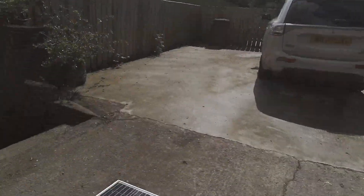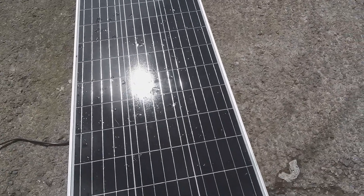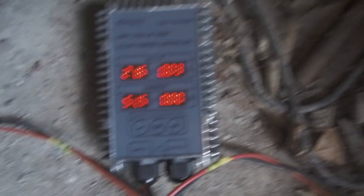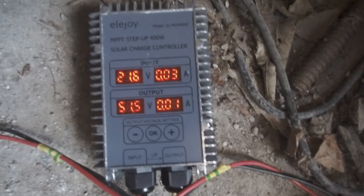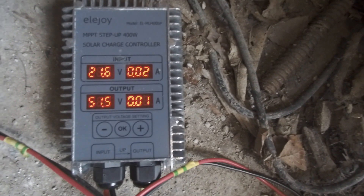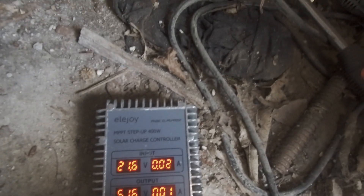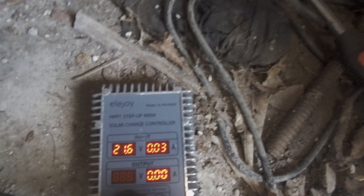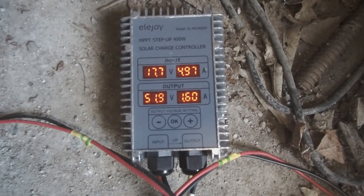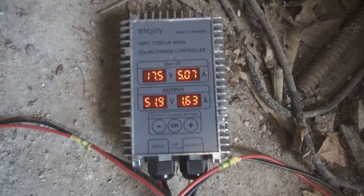There's quite a bit of sun today, although there have been a couple of showers as you can see from the water on the solar panel. We are at target — 51.5 volts. As you can see, even though it's sunny, it's not actually pulling a lot of power. It's just ticking over at the minute, so it's basically shut off. So if I actually push it up to 52 volts and hit OK — boom! There we go, 5 amps. Awesome.